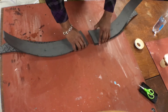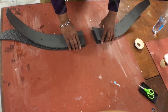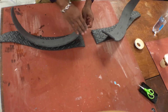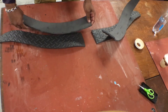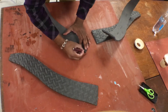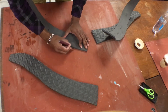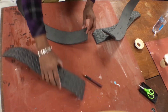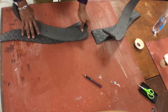The front of your bow has that curve to it. We're going to cut this at a 45 degree angle — make our marks and cut the whole thing at 45 degrees. You can do this one of two ways: with an exacto knife, holding it at one particular angle and dragging it all the way around making sure you don't move your hand. I have a bandsaw available at the shop so I'm going to use that to make it a lot faster.